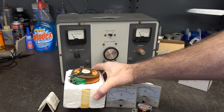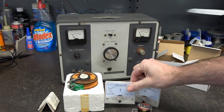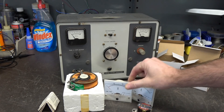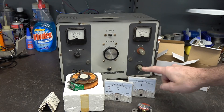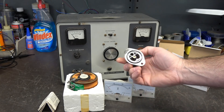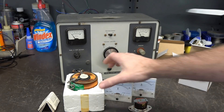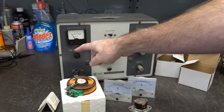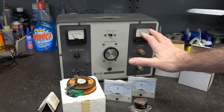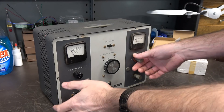What do you need? We obviously need a bare AC variac to start off with — this is a three-amp model. I've got a couple of panel meters here that I bought from All Electronics, so we've got our volt meter and our amp meter. And here is our chassis-mount AC outlet for the power. We're going to reutilize the layout, the power switch, and the fuse, but we're going to have to remove all the DC components — that's the first step.